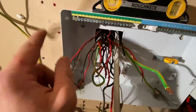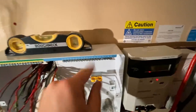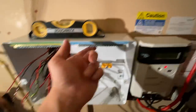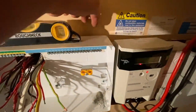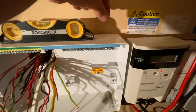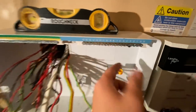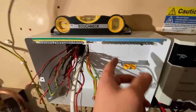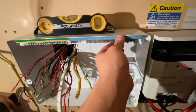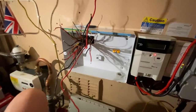I've got three of the fixings in. Don't push that back to the wall — that's where it wants to sit naturally. So what we'll do is pack some washers behind there, just two or three washers to give it five or six mil, and then I'll put the last screw through. It will just mean this is going to sit flush. This is the biggest problem with BG boards — this flexing of the lid — but the fuse box aren't too bad. You don't want to fix it with that much gap.